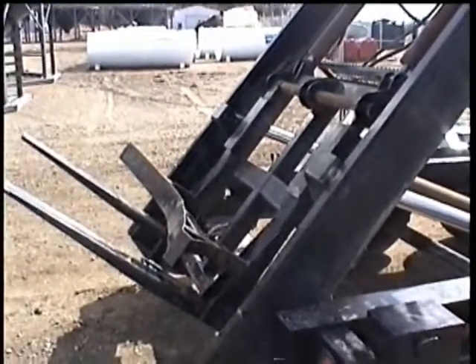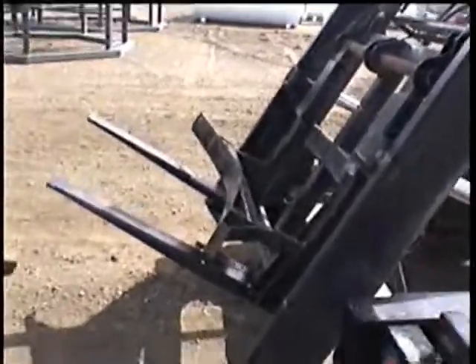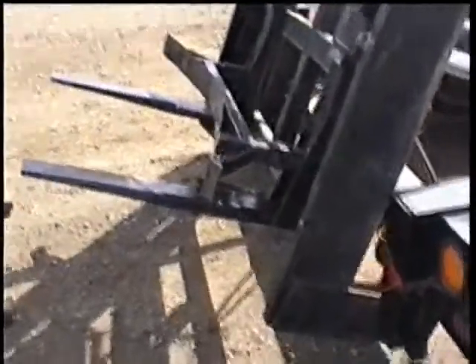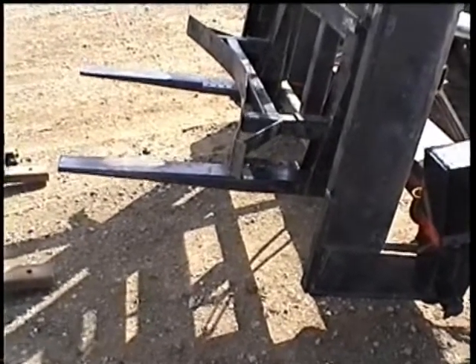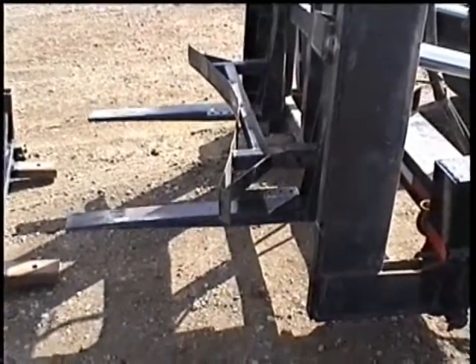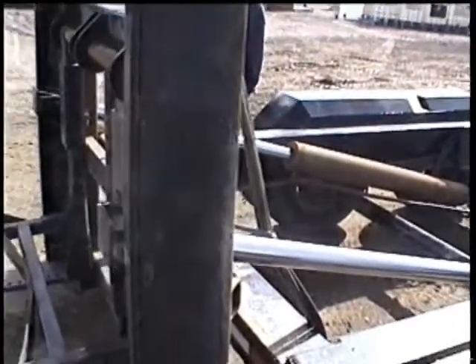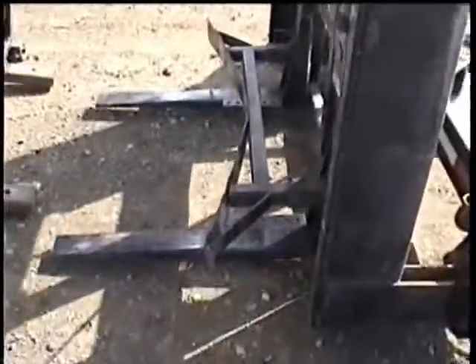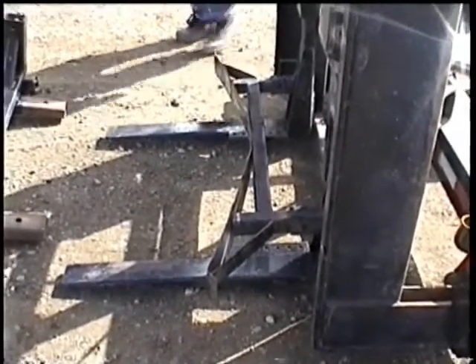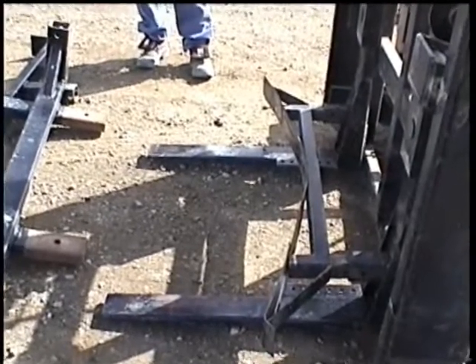If you go to an existing site where the skids are already down and the floor is almost sitting on the ground, we can come over centre enough to start with the forks and then as you get underneath the deck, back in. Every site is different, but usually there's grass growing up and those floors are rotten, so we do tilt it up. We can lower our forks with the hydraulic system to have them dig into the ground slightly to get underneath a floor that has sunk. We would monitor what kind of dirt we're on to make sure our tires don't cause us to puncture the bin with the forks. We want to make sure everything is in place.